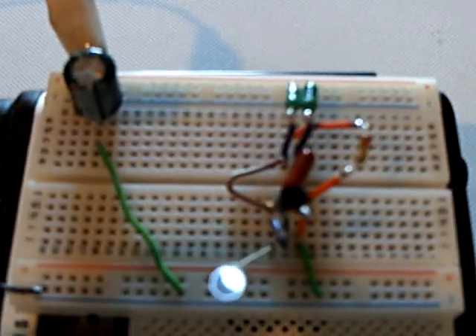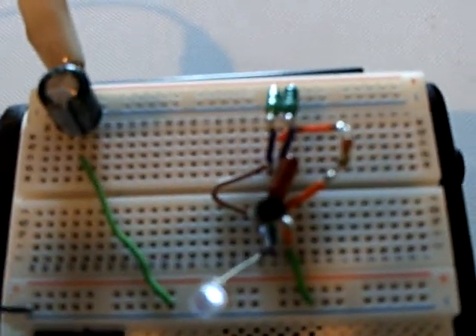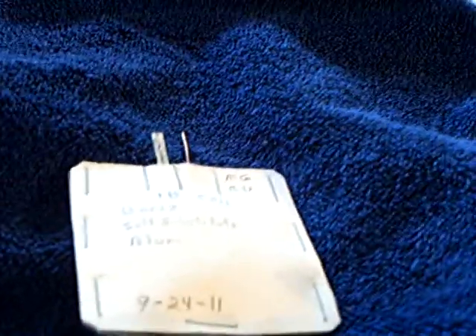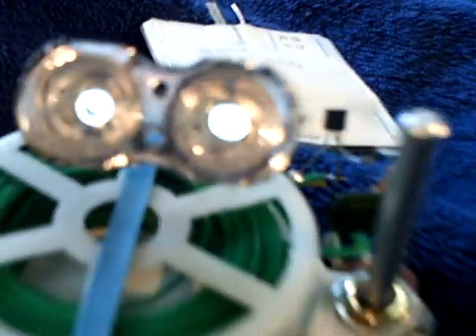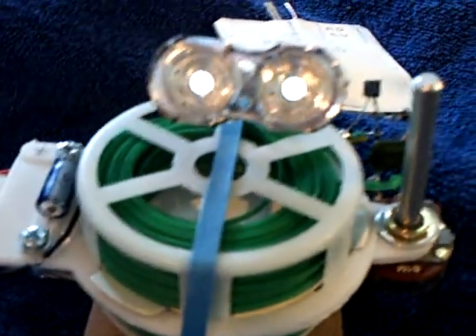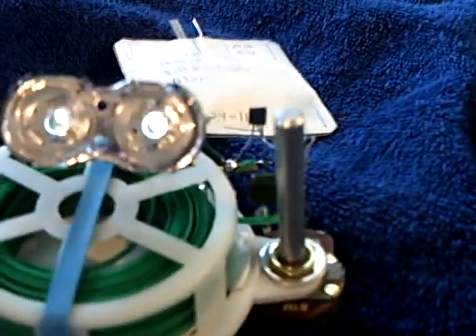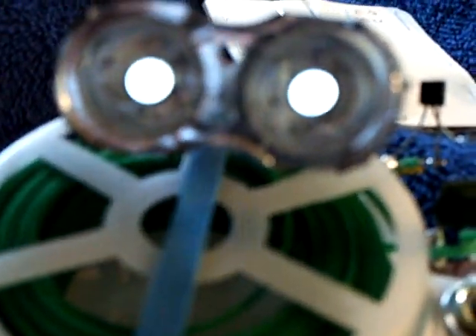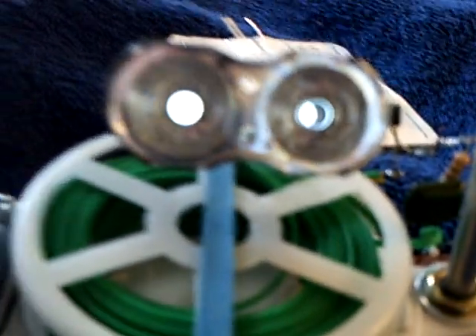It's the penny circuit. If you go back in my videos, you'll find a penny circuit. The penny oscillators are doing fine — they're blinking away here. I've got penny number two hooked up to one of these IV pointless stovetop cells, and I'm checking that voltage every day to compare the two. Penny number one is still higher than the voltage when it was new. I still don't know why, when I was gone for five days, the voltage went up — and it just stayed there, higher than when the cell was brand new. I've checked it with several meters to make sure it was accurate.